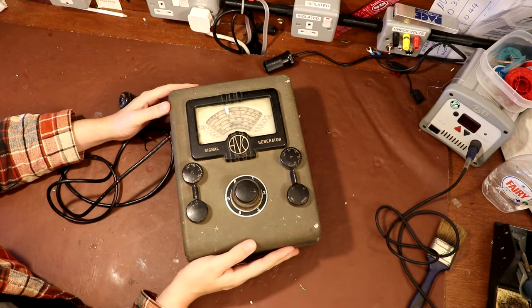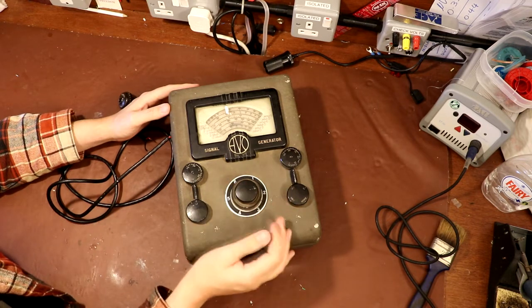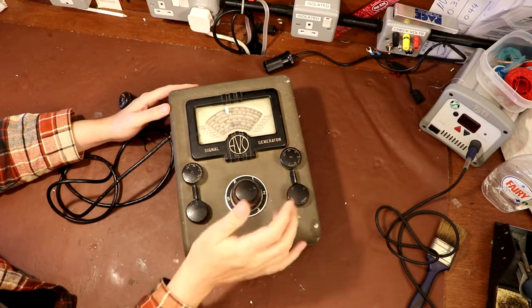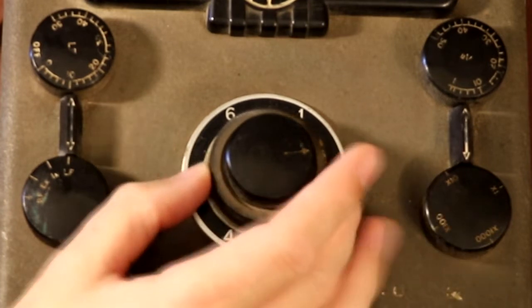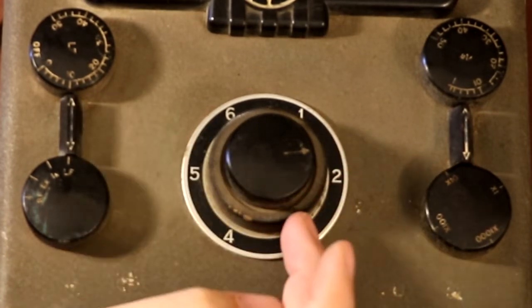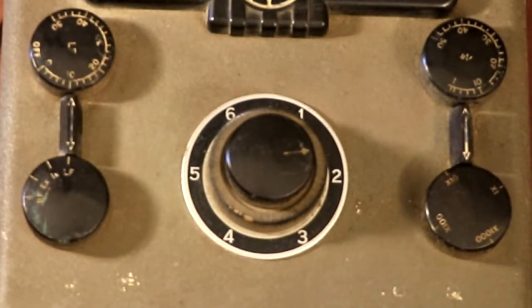From memory, last time we opened up and had a look inside the AVO it actually looked in really good condition. It's going to need the usual electrolytic capacitors replacing and coupling capacitors, but the main problem I identified was with the two tuning rings — one chooses the scale you want to operate, and the other should turn when you rotate the second dial. There's obviously some mechanical coupling between the variable capacitor and the knob, and something mechanically isn't functioning there. We need to tear into this and find out what's gone wrong.